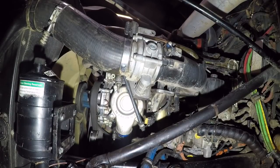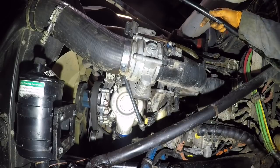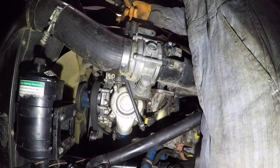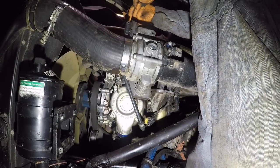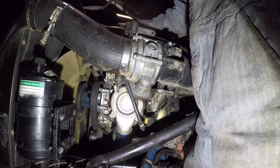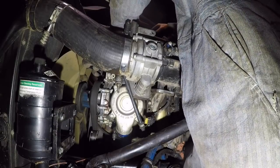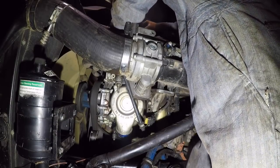The first cat, I've got to pull the valves out of the controls that control the hydraulics for it. And Joe told me that they had this problem before with it leaking by, and they had to have the spools sent off and re-chromed. So I don't know. I'll pull it apart and see what that looks like. But